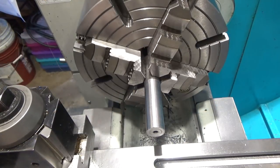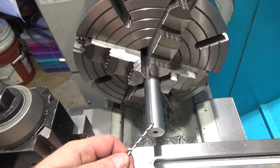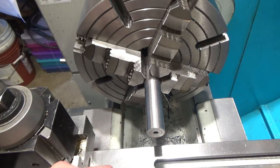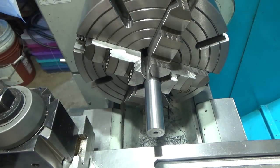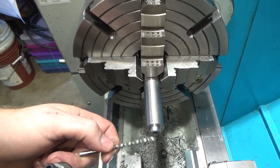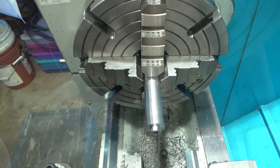So I have the stock drilled and tapped with a 1/4-20, and now I've got to reduce this dimension to the small dimension of the slot, leaving the back part, the outer dimension, which it all is right now, that's the slot width. So I'm just going to make a bunch of round T-style nuts, and I've got a way to prevent them from spinning in the slot. And I'll do that in the mill. I'm just basically going to put a little pin sticking out. So now we are drilled, tapped, profiled. Now I just need to part it off at the proper depth.